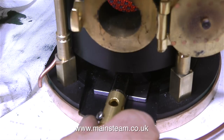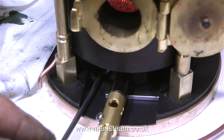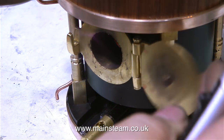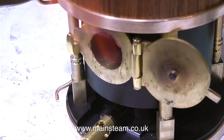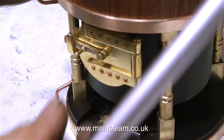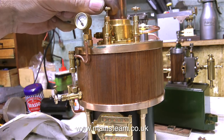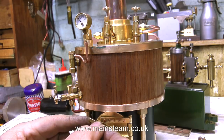What I'll probably do is fit a metal plate to the bottom of the burner. For now though, I've just put a piece of plate underneath, and it lifts the burner just enough to keep it in position in the firebox. You have to be careful when lighting gas-fired boilers because they do this — and it looks a lot better in slow motion. This is a coal-fired boiler with a fire hole door that it doesn't really need if it's been gas fired. The combination of this small boiler and the quite large burner is good, because in no time at all there is some pressure in the boiler.